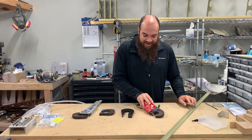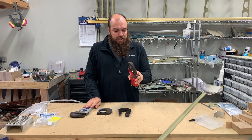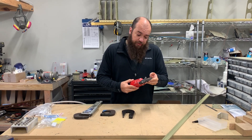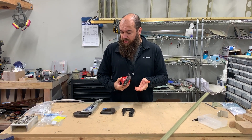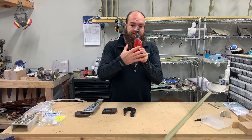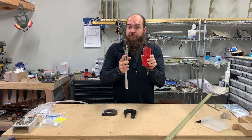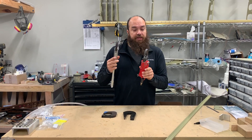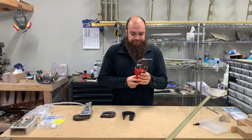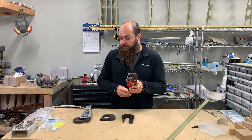It is heavier — some of these tools are quite heavy, this is probably around eight pounds, so you're going to get some strong arms. But there are a lot of instances in which the pneumatic squeezer won't fit. You can see how wide it is compared to the manual one, so there are circumstances where the manual squeezer is really the only chance you're going to get of squeezing that rivet, or usually it's actually a dimple.